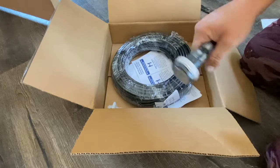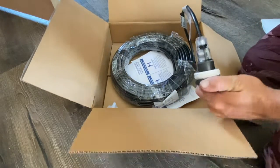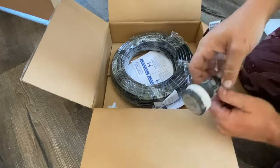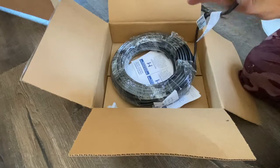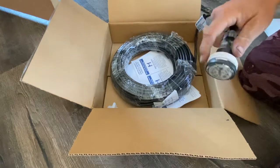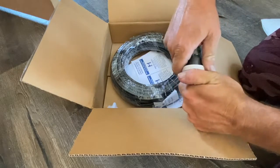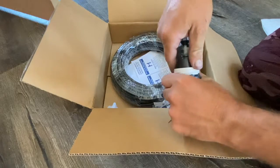But if your equipment is below grade, and or you are worried about freezing in a pipe that's just full of water at gravity, the dry seal is a super cool thing, and that's the reason the IntelliBrite lights are a great light. They provide a lot more lumens than these lights, but there's no way to dry seal them. Okay, so let me do that again. It's like a prescription bottle.